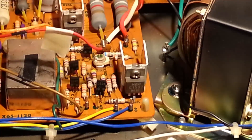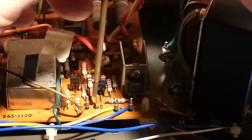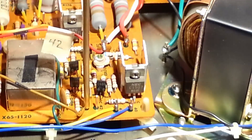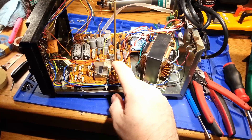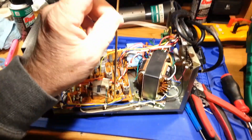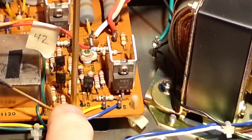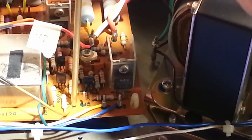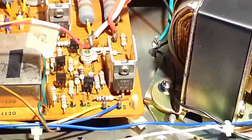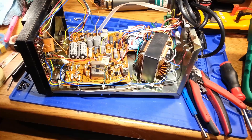This is the best way I can figure out to handle these pesky little wire wrap connections quickly, making yourself a low budget tool. This hobby metal tubing will probably cost less than $2 if you can source one from a hardware store. But you've got to remember that you put the pressure on the inside tubing. You can make this a lot shorter — you can probably even make a handheld tool out of it. The inside one is the one that's going to have the pressure and the rotational torque. I'm going to spin it until I feel it grab and you can see the wire came loose, and it comes right up and I'll just push it right out the end of the connector.